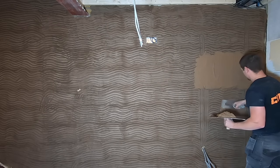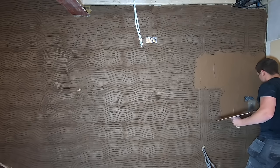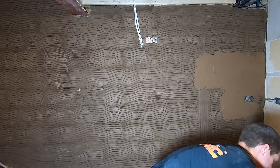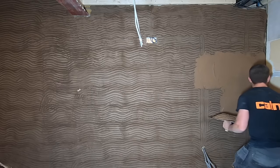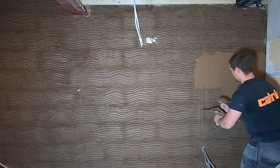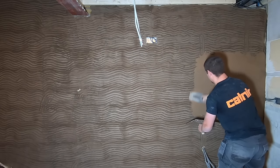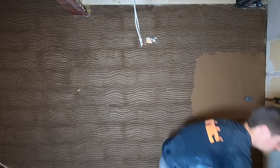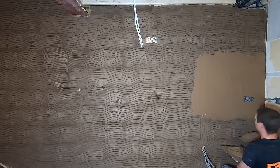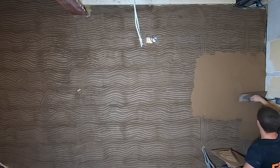It's nothing far from what we were doing before. Put it on, watch out for the plug sockets. I've swept the floors, so when I do drop some I can pick it back up. All we're doing is just putting it on — nice tight application, really pushing into that scratch. You'll find you've got a bit more time as well, because the scratch coat is quite damp, which gives you more working time. It's quite nice to do it on the same day.